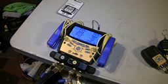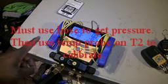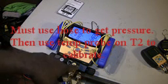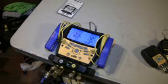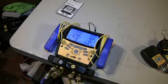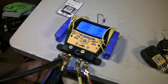The other way is you calibrate by test pressure, and if I'm not mistaken, you would take a temp probe without the clamp, and then tape it to the side outside of a cylinder, measure the temperature of the cylinder, and then you would set the corresponding pressure to that. So that's the other way to do that. I believe that is the way to do that. It's been a while since I've read that part of the instructions, and that is now officially it.